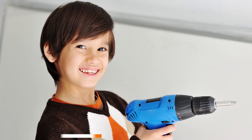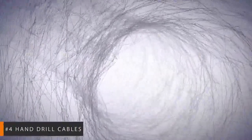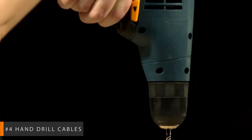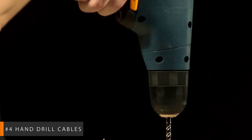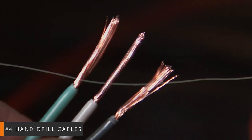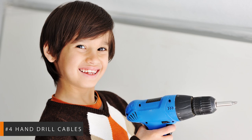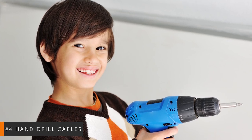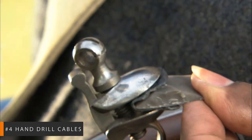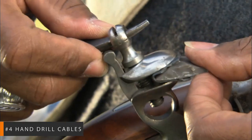Number 4: Hand Drill Cables! Here's a good hack for taming tangling wires on wiring jobs. The solution is absolutely electric! You can actually create a neat cable out of individual wires. Just grab an electric hand drill and the assistance of a human or a clamp-type vise. Get your wires together and straightened out as neatly as you can. Then twist the first few inches of the wire together by hand and bend it in half to resemble a hook. Next, open the chuck of the drill as wide as it will go and place the hooked cable inside. Tighten that chuck so it will firmly grip the wires but is not causing any damage.